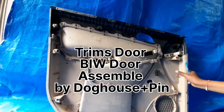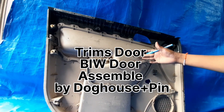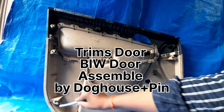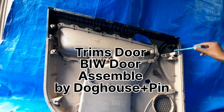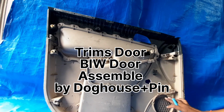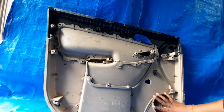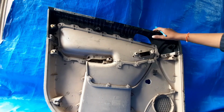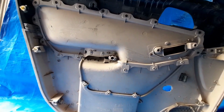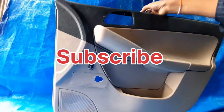Now between the BIW sheet metal part and this plastic trim part, there is a sandwich kind of assembly that will be assembled with this final door with retainer pins or push pins. Inside there is the power window mechanism, some lighting, the harness connector, and the speaker grill harness wires. Then the inner release assembly will be there. This we will see one component at a time.